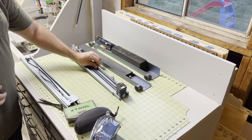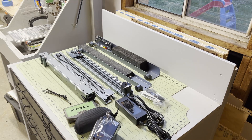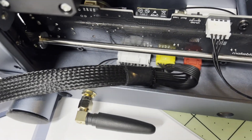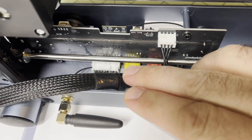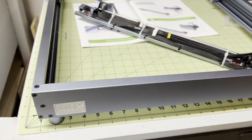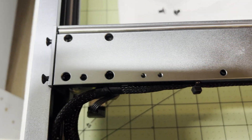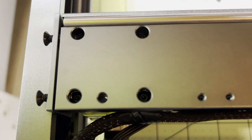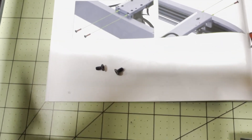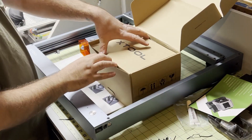I've put together my share of 3D printer kits and other tools, and this was basically a few steps from start to finish. There were only two places that slowed me down a bit. First was plugging in the cables into the control board — it's a really small area to get them plugged into, but as long as you line them up the right way and take your time, it was fine. Second was when connecting the laser gantry to the main frame. The manual shows using long screws to connect it, however they interfered with the screws that hold on the motor. But they did provide shorter screws which worked perfect, so I assume it's probably just an update somewhere in the online documentation that's not in the manual.